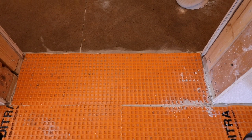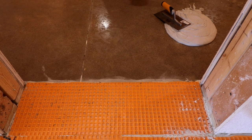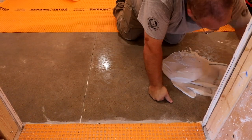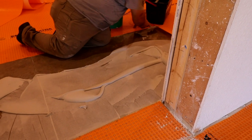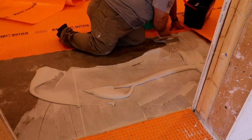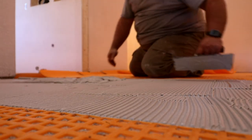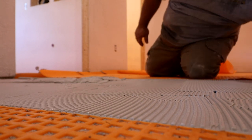We're kind of asking the same thing out of an uncoupling membrane — we're uncoupling from the house, disconnecting our tile from the house. Now that makes most people panic and they think, 'Oh, you're gonna make my tile a floating floor install like an engineered floor?' Not at all. The bond is still there, it is still connected. It's just not in the way that you traditionally would have anchored tile. Ten years ago it was a bed of mortar, then backerboard, then a bed of mortar and tile — meaning whatever happened in the substrate was connected by mortar and backerboard all the way through to the tile.